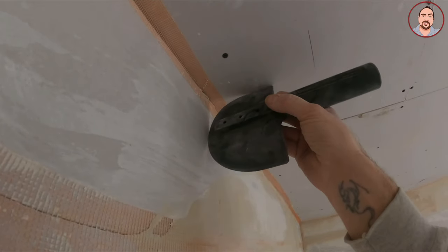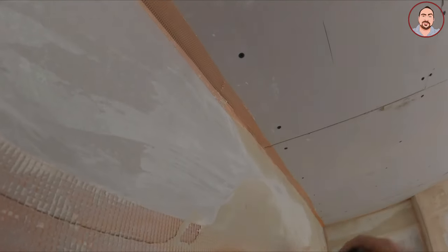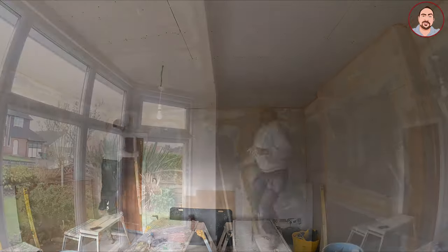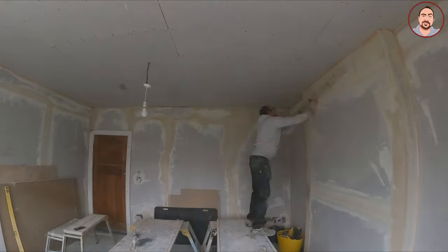I just need to get a nice swipe if needed, and I can also run that way with a small trowel as well as using this tool. It's about 20 centimeters away from the wall — I'm going to measure that all the way around. As you can see, we've got it all marked out. My next point of call now is to stick some bonding on with my new tool, which I'm looking forward to trying out.